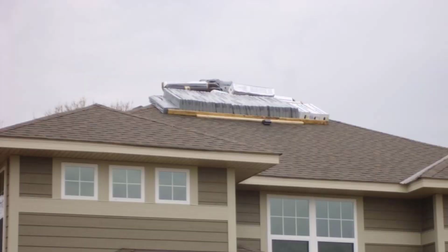What do? I'd say, number 1, you have the roof torn off and redone, assuming it's a new installation. Now, if I'm finding this kind of stuff on a 5-year-old roof, well, it's 5 years old, nothing has happened yet. I will let my clients know that it's not properly nailed, but there's really nothing you're going to do about it today. But when we find this stuff on a roof that has just been replaced, or it's a new construction home where it was just installed, that's something where the installer should have a little bit more responsibility to do the installation correctly.